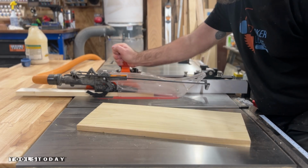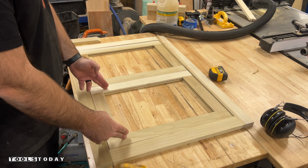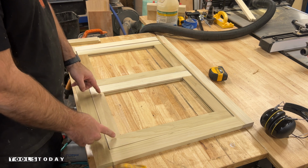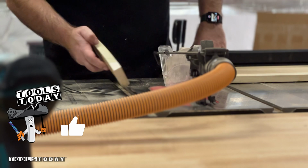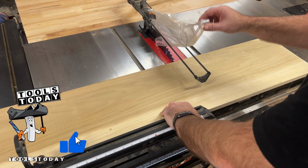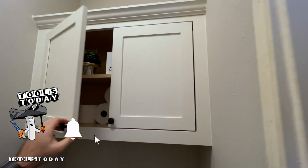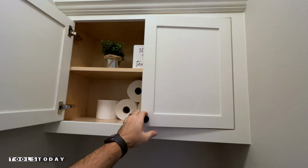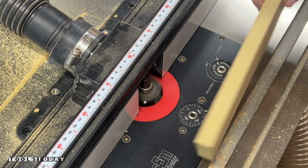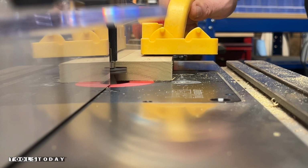When preparing to make cabinet doors, you want to consider the type of hardware and overlay you'll be using. The stiles are the vertical pieces on each side, and the rails are the horizontal pieces that fit between the stiles. I cut the rails and stiles from the same material as the face frame, which is 3/4-inch poplar. The outside of the cabinet will be painted, and poplar is an inexpensive option for painted surfaces. You'll see that I mark the fronts of each piece and make sure that side is always facing down on the router table, so the rails and stiles match up.